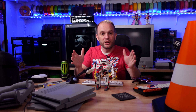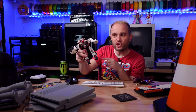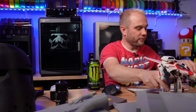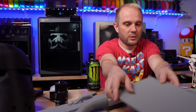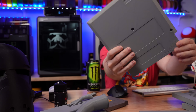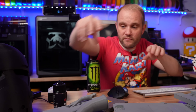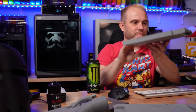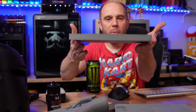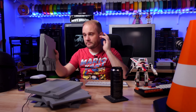Then the K2 Plus shakes so much. On the bench behind me on the television, you can see the Transformers and the Gundam — my G1 Jetfire. It knocked them off along with Thrust, knocked them off the television. My original ones from the 80s. So the same thing — everything looked good until we got into a corner, and the same corner was having trouble on multiple prints. It was warping off the build plate. So I applied some Vision Miner Nano Polymer adhesive — amazing build plate adhesive — but I walked into the studio and the build plate was still stuck in a bowl shape, like both ends were curled up, and that ruined it.